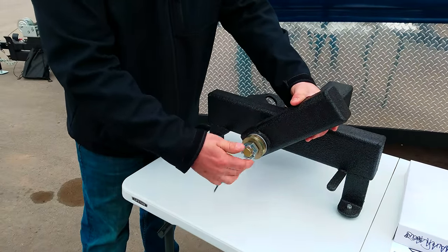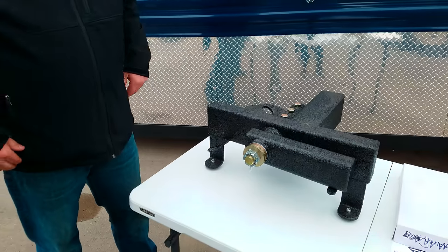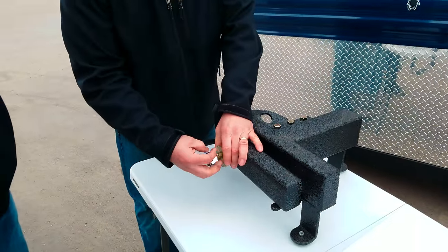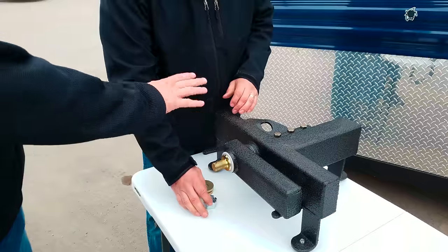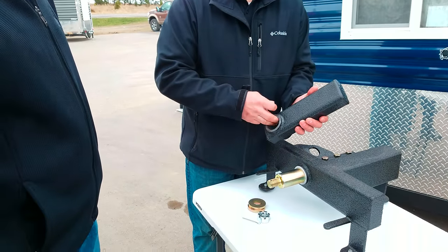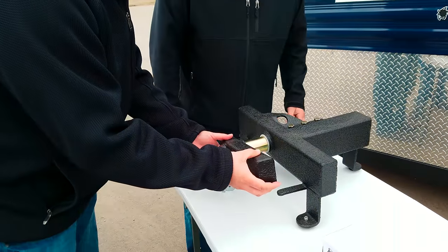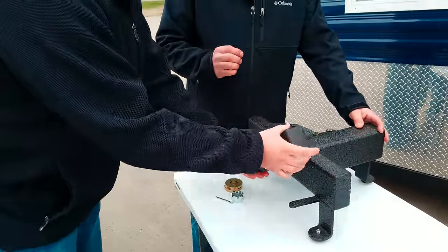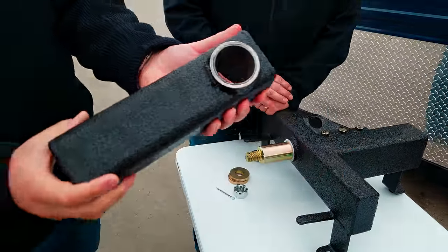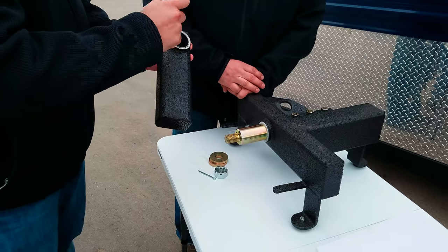The nice thing is that this whole thing is repairable and serviceable, and it makes for a grease-free system. This whole piece just comes right out with just three bolts, so it makes it pretty easy. The manufacturer of this bushing does not recommend using any type of grease or oils — the drier it runs, the better. I was playing with this earlier and it's amazingly smooth. Everything is machined within thousandths of an inch tolerance, and we have to hold that to keep the parts working together, all done on very high-end machines right here in Minnesota. There's no metal on metal — that's why it's so smooth.